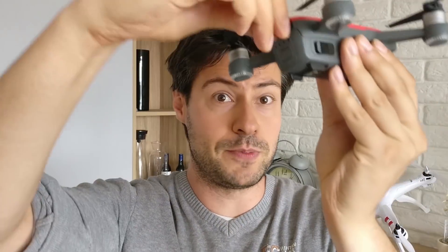The next advice is related to the gimbal. When you want to download pictures, probably the easiest way is to connect a USB cable to the drone's USB connector and download them to your computer. You have to carefully place the drone on a flat surface, because if you leave it on a pillow like I did, it can block the gimbal. While the drone is on, the gimbal keeps trying to compensate and fix the camera position — if it stays stuck for a few minutes it will overheat and could even damage the gimbal motors. So always place the drone on a flat surface.